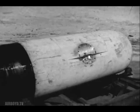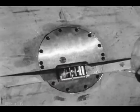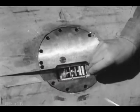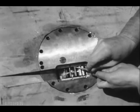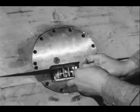A valve — the water trip delay valve — prevents the torpedo turbines from burning up during its long air travel. On leaving the plane, the torpedo is operating only by compressed air. Impact with the water trips the valve, starting normal fuel operation. This valve is secured with wire to prevent the air stream from springing it. Similarly, high speed and altitude make it necessary to prevent the impeller on the exploder mechanism from turning while in flight. A piece of 0.020 annealed soft copper wire is used; impact with the water will shear the wire.